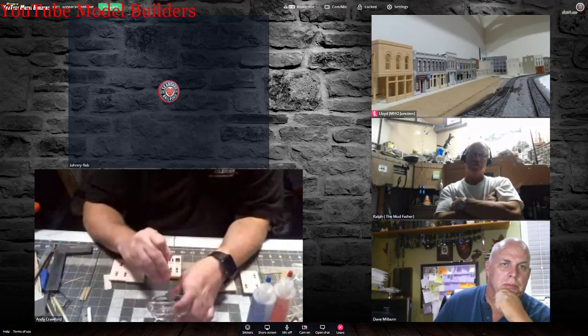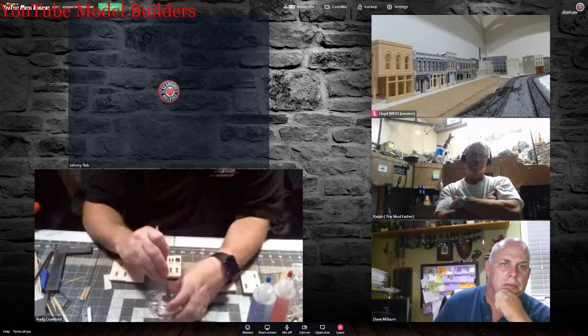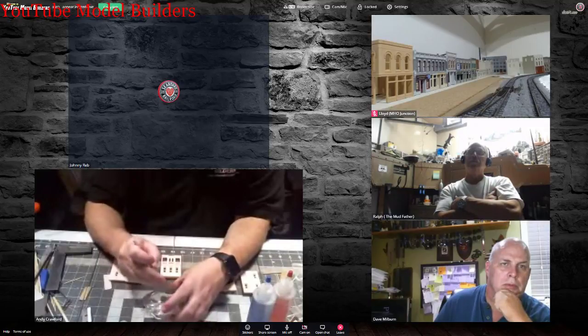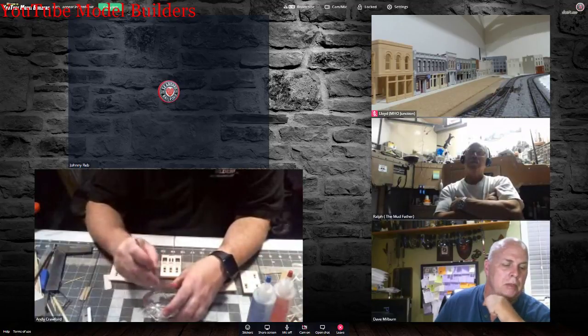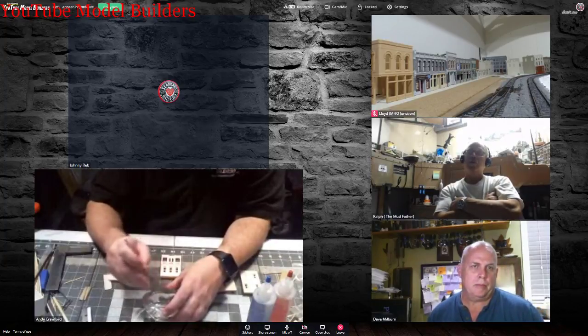There are some advantages at times to adding more or less hardener depending on the results you want. If you wanted a somewhat rubbery effect, like a contact adhesive type effect, you can use quite a bit less hardener and it will remain a bit rubbery for a pretty good long time. It'll eventually get brittle, but it'll take years to harden up.